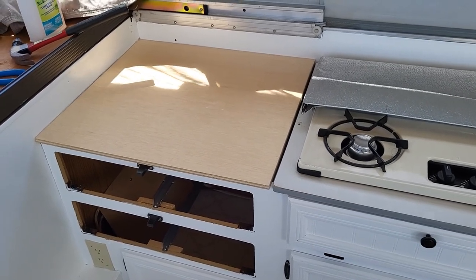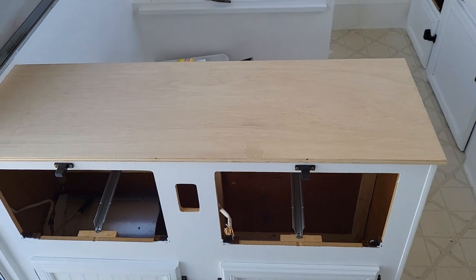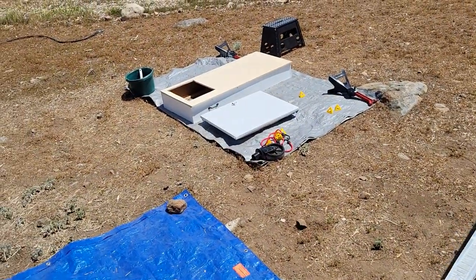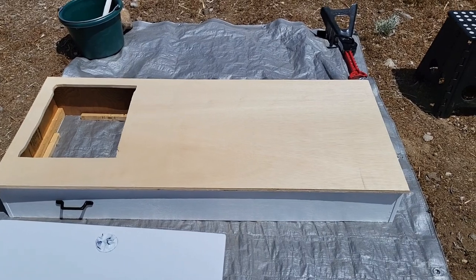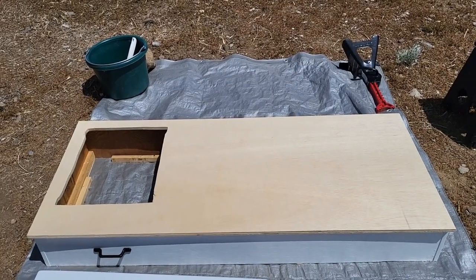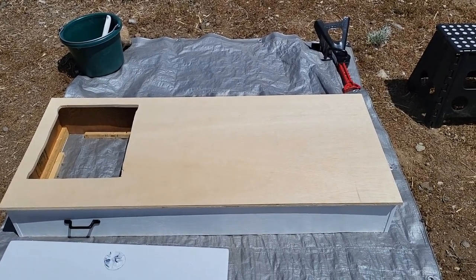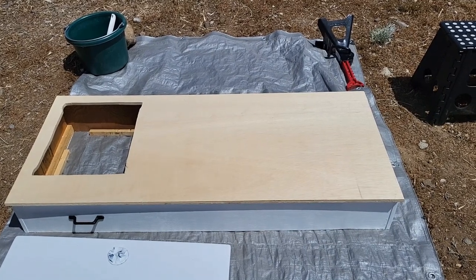The next step is done — we have cut our new countertops. That one goes there, here is the entry counter, and this is where the sink counter will be. We didn't cut the hole yet for the faucet because we might be changing faucets. Today or tomorrow morning I'll sand all these down, then apply a medium-to-dark wood stain that's a poly coat and stain in one. I'm going to do both sides so they're equally treated.